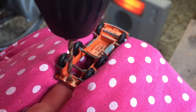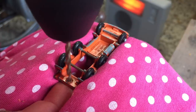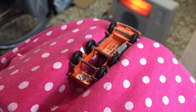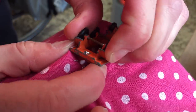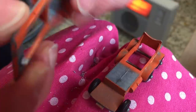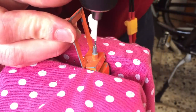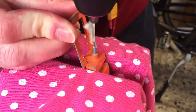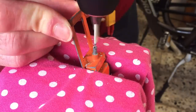The other rivet comes off by using the same drill bit. I have to be very careful with this one because there is almost no rivet post behind the rivet. I want to use the small post to clip the base back on once the model is painted. When the body is separated from the base I drill a 1.5 millimeter hole in the rivet post of the barrel. A couple of my subscribers suggested using some oil on the rivet post while doing this, which together with drilling in small steps at a time avoids breaking the drill bit.